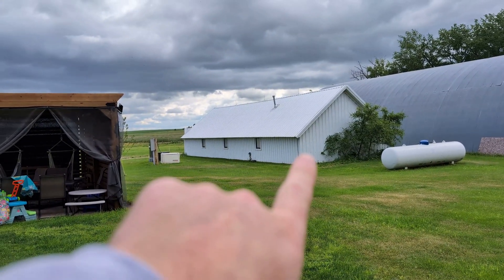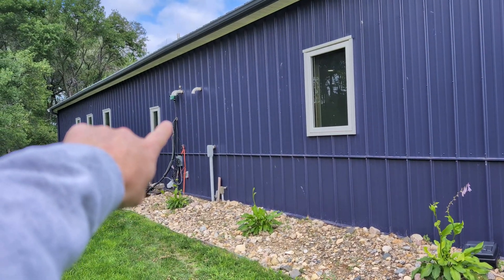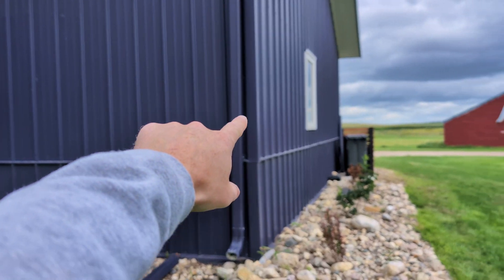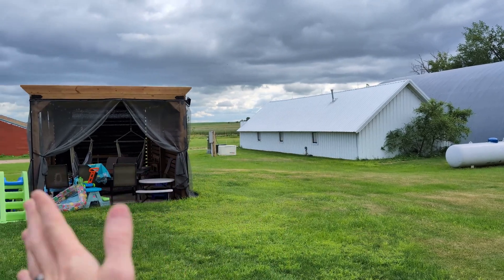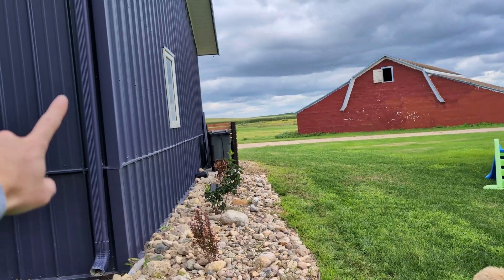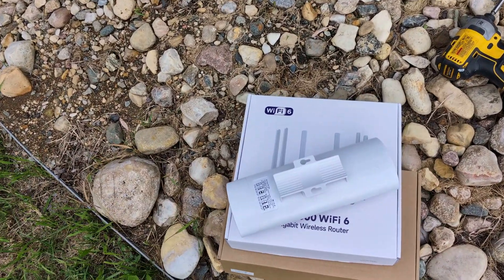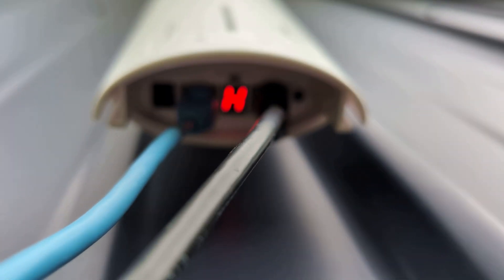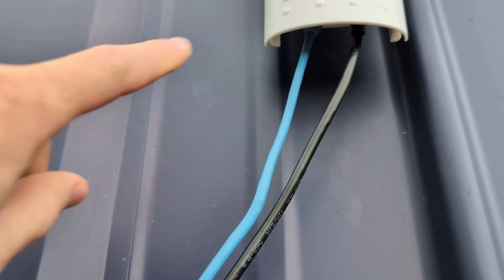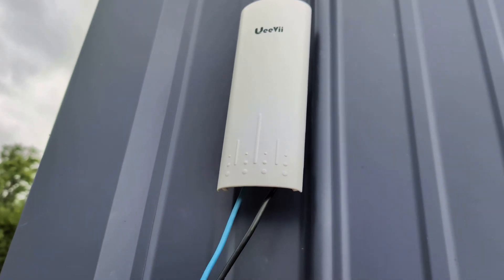The ultimate goal is to get wireless to my wood shop, which is this building — and here's my house. I'm going to run the cable along this wainscoting and mount the bridge on this corner. It needs to be in direct line of sight with the wood shop, with nothing in between. I have a clear path from this corner over to the shop. I'm going to mount it onto the house using sheet metal screws. Now that the power supply is plugged in, you can see that light is on and it's flashing H. The left port is power; the right port is the ethernet cable to the router in the garage.